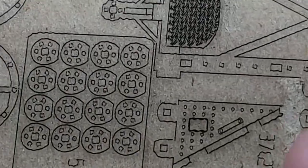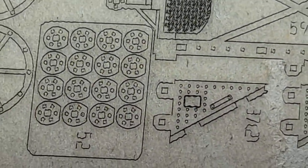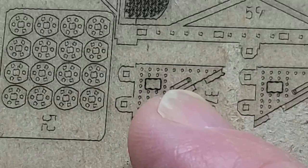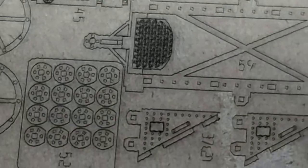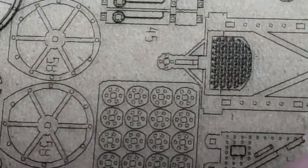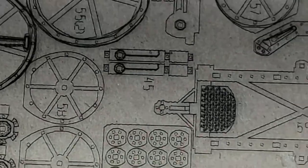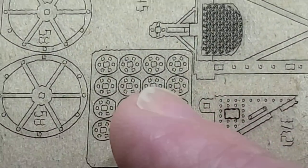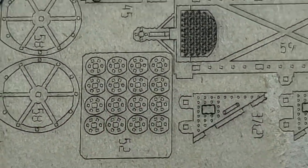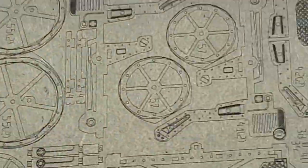You can just see where there's this bit of waviness going on here. And really with these lasers, this is a tenth of a millimeter point. You can see how big my finger is. You can't see any of this stuff with the naked eye, so it really is super accurate. But when you really get down to it with microscopic stuff, when you're cutting super fast, this is like 2,000 millimeters a minute, which is about 80 inches a minute, which is pretty darn quick. But you get a little inaccuracies. You can see the little hole shapes just aren't super great. We come over to this section here, we can see the little bit of waviness, and it just happens to be a slight bit of vibration. I think adding some weight to the frame would help.